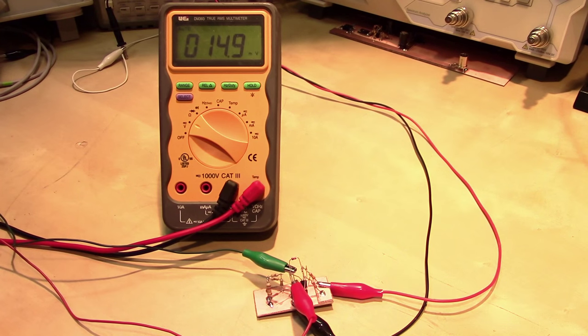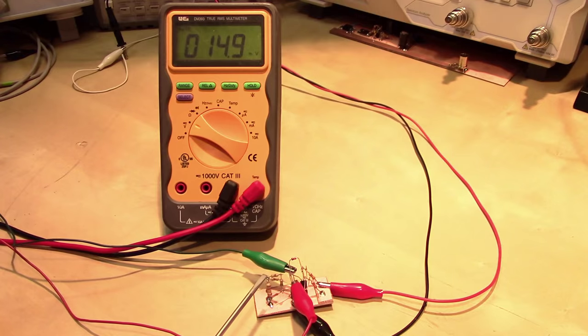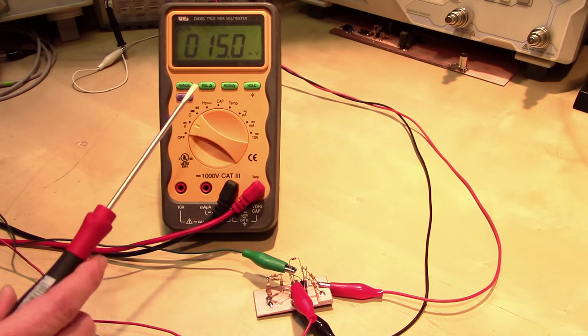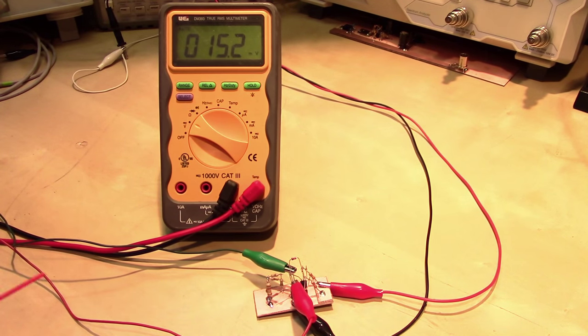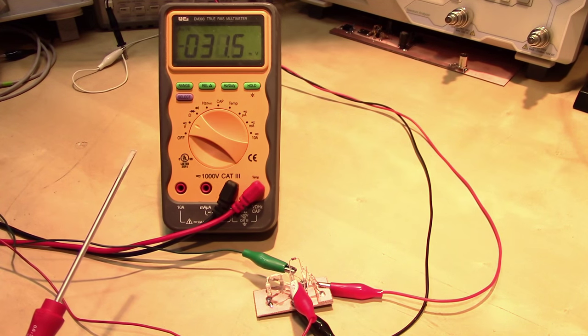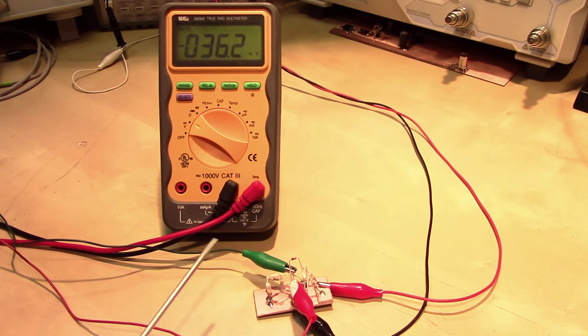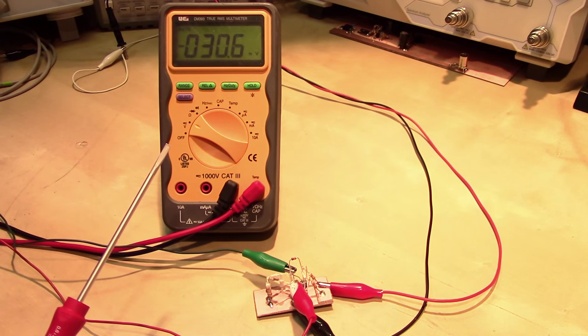This is a pretty easy theory to test. I have that left half of the circuit built up here on the bench, with a multimeter connected across the two points that would go into the differential amplifier. We'll see if the voltage across those two points significantly changes as temperature changes. We can see the voltage is dropping pretty drastically, still going down. As the circuit warms back up, we should see that differential voltage start going back up towards zero — and there it goes. So this half of the circuit is absolutely responsible for sensing temperature changes.